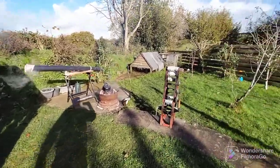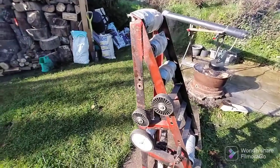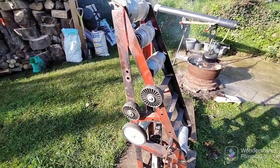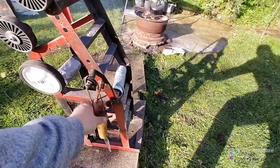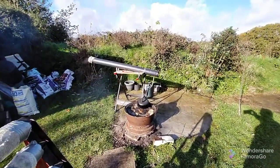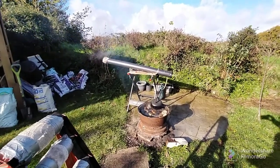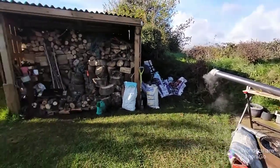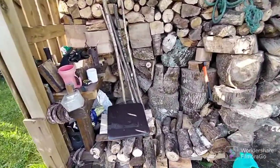I'm just sitting here watching the world go by doing this — which isn't too bad a job. And this is how I'm straightening my sticks: they're just being put through these rollers and being bent either way that I need to achieve the actual bend. Obviously the saw is to cut to length. It's quite a pleasant and fast way to do this — every 20 minutes I'm doing three or four and putting the next lot in.